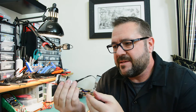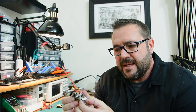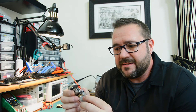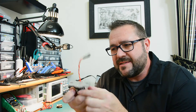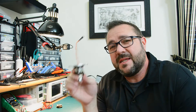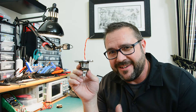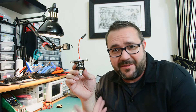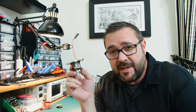There are tons of different hotends, but they're all built on a similar fundamental — they just have different heating elements and thermistors, which is basically how it determines how hot your hotend is. They'll either be axial or radial leads, but they ultimately plug into a wiring harness and facilitate the process of extruding the plastic material on your print bed. This is a Lulzbot TAZ 4 Budaschnozzle version 2, but there are tons of other hotends — you can see a few of them here. Plenty of variations.